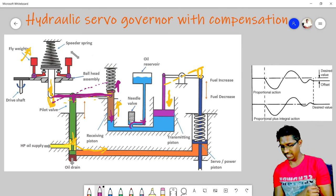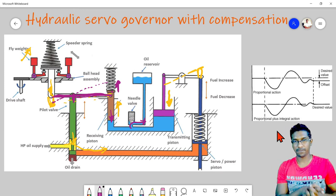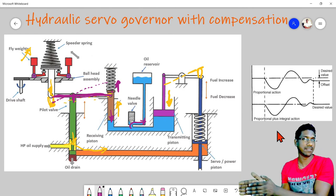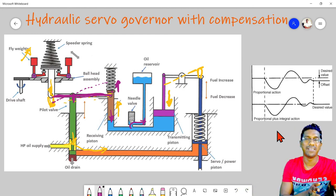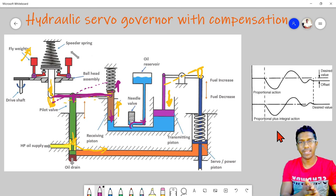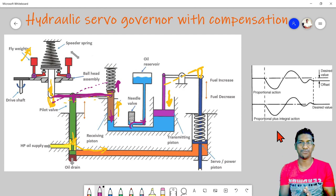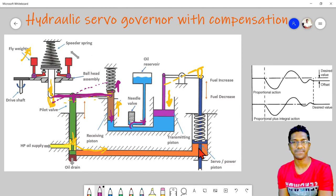In our next video, we will discuss load sensing and speed sensing governors, because before any speed change happens, there should always be a load change. So the first thing that happens is an increment or decrement of load. Depending on that, speed is then affected. So if we have any arrangement to detect the change in load, then our responses will be faster. So we'll move on to study speed and load sensing governors. Then we will have more accurate and more responsive arrangements.